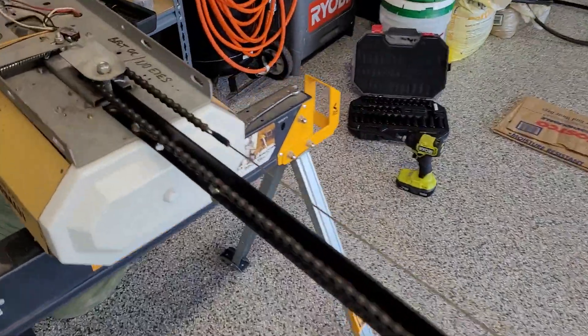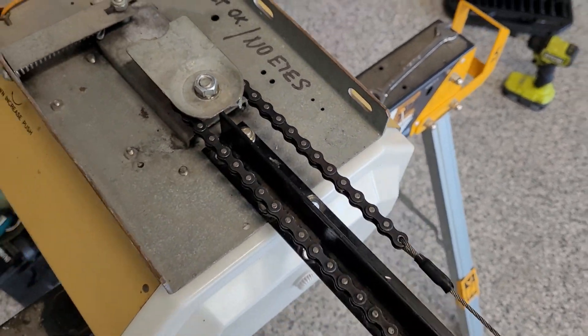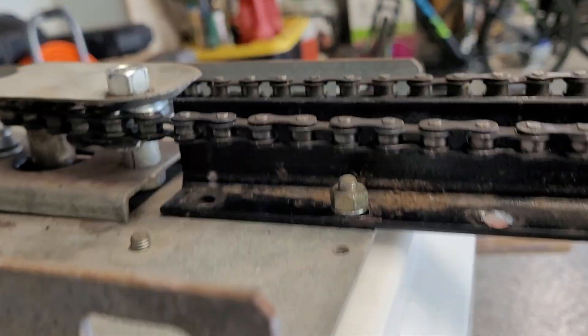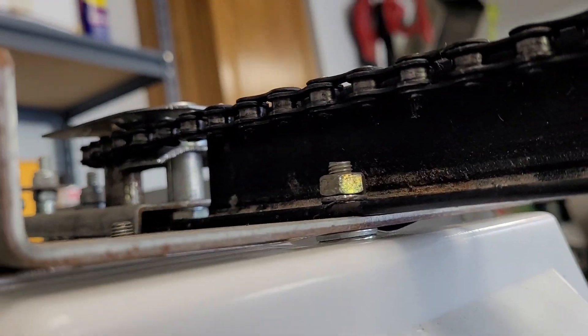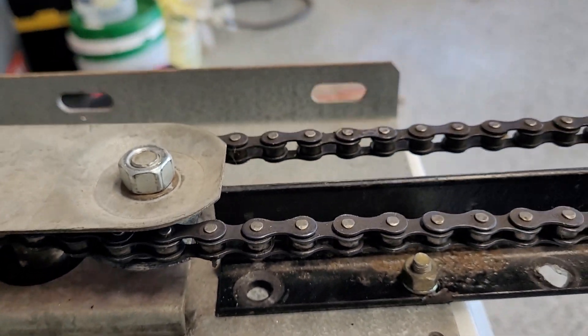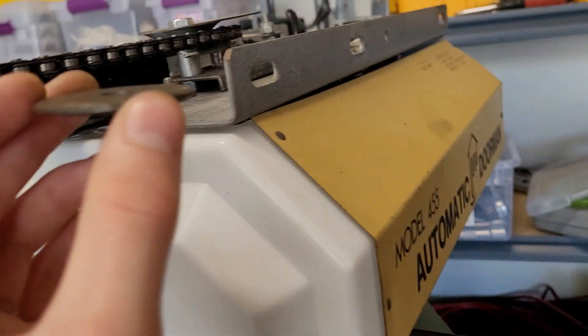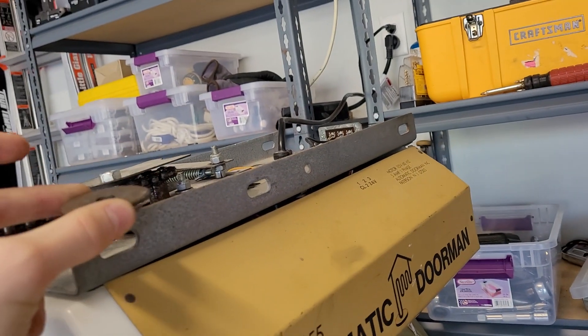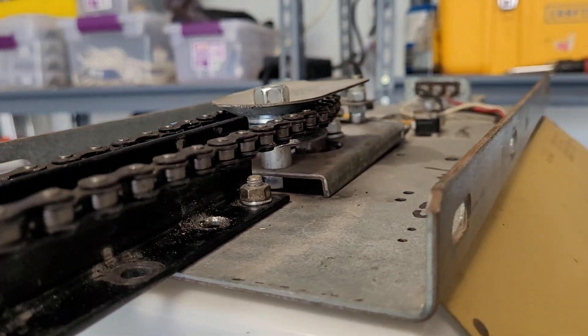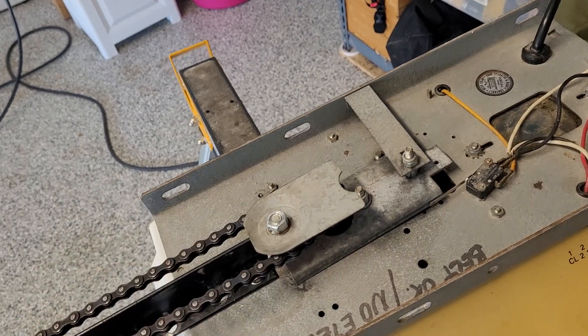I did need to drill a hole up in the front here to get this to work. The other thing I had to do is cut this little bracket down there — you can kind of see how it's rough on the edge where I had to cut that, because otherwise the rail would run into it. There's another piece — it's on the floor here — this is part of the chain spreader piece. It goes between those two metal plates, but if this was on there it would run into the rail, so I replaced that. I have three washers in there instead to space it out, and those washers are smaller so the rail won't bump into it.